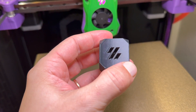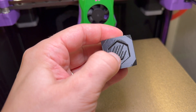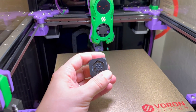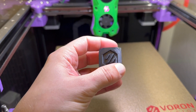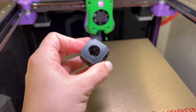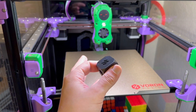Resonance frequency calibration looks pretty good considering the speeds. I need to figure out the overhangs and the cooling — I've been printing in a closed-door environment here, and PLA doesn't really like to be printed closed on this specific printer because of the cooling. Maybe I will add an auxiliary fan later. But so far so good, and that's pretty much it for this video.